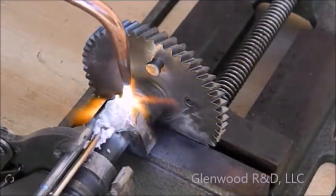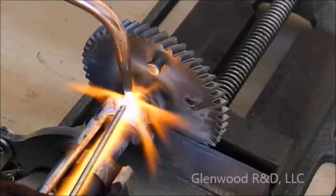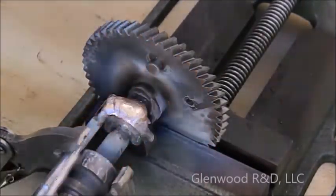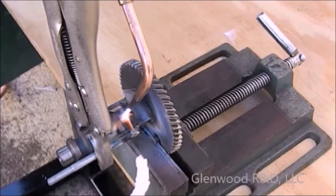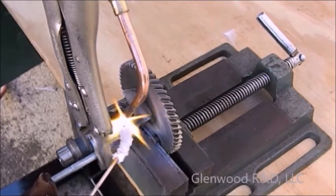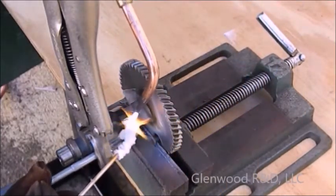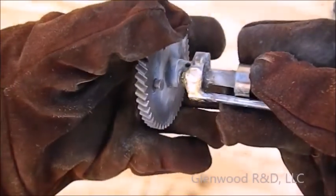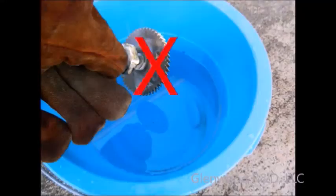Working slowly towards the new lobe until one side of the lobe is fully brazed. Repeat on the other side. When you are finished, you should have a contraption that looks like this. Do NOT try and artificially cool your work — the dissimilar metals need to cool slowly and naturally.